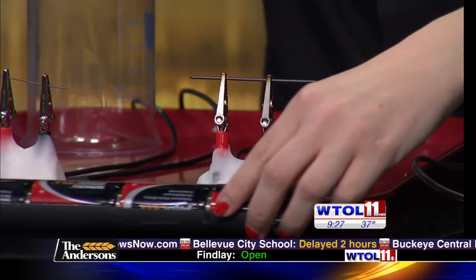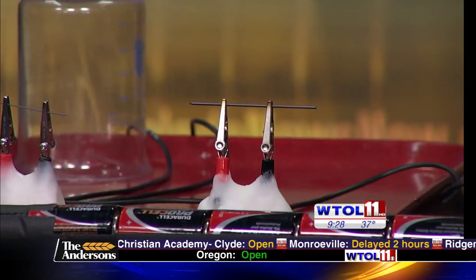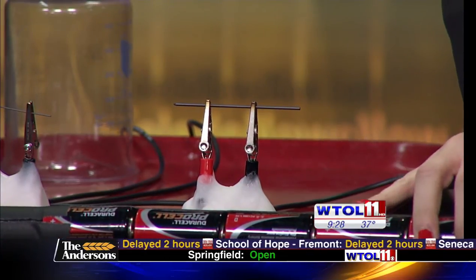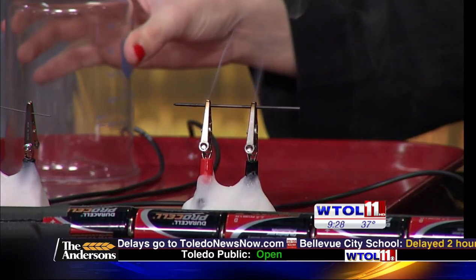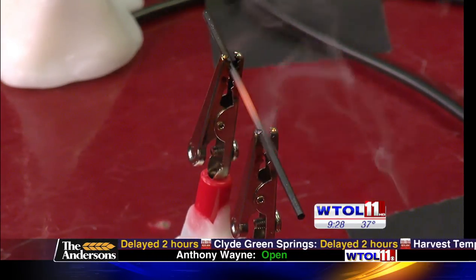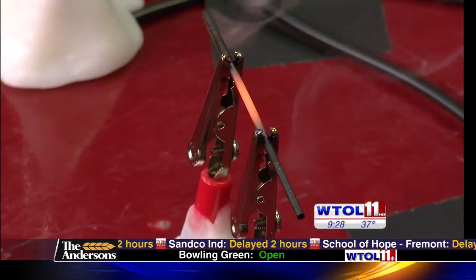That filament was really thin, so it didn't last very long. Over here I've got another piece of pencil lead and it's considerably thicker. We're going to try the same experiment — move our battery train down a little bit and apply those same 18 volts. In theory, this one should last longer because it's a lot thicker. Go ahead and put your alligator clip on there. We can see that water vapor coming off again, and this one is not really lighting up like the other one did — still pretty dark. But wait for it — there it is! It just takes a little more time. This pencil lead is so much thicker, it has a lower resistance, so there's more surface area for those volts to travel through, and it takes longer for the pencil lead to heat up.